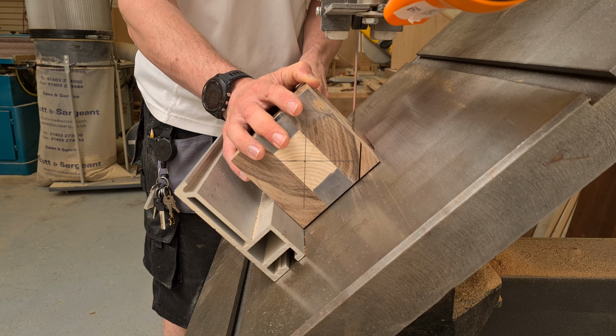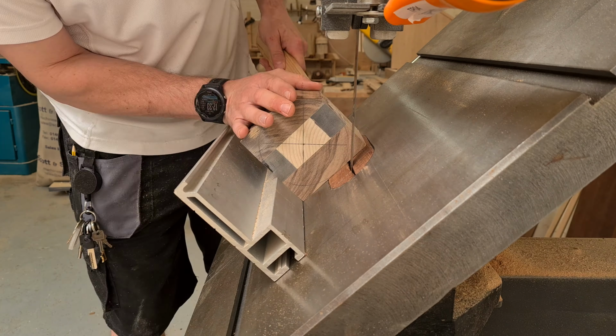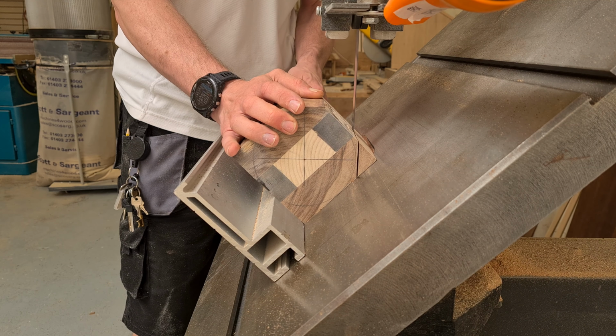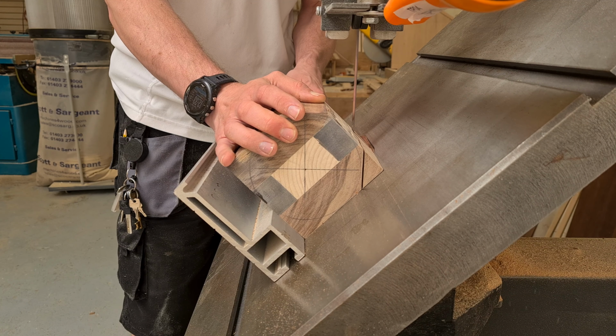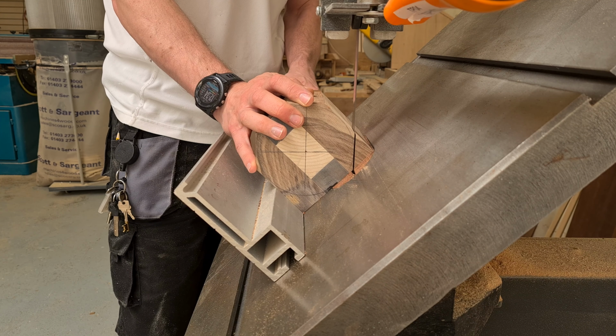Trying to match the style of the project with a shape and also a suitable colour is difficult enough without little problems creeping into the mix. Now, the walnut had released tiny little air bubbles into the resin when curing, so I had to rip out that section and start again.